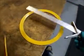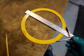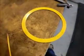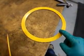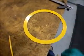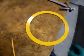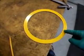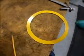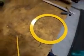I've taken this center finder and I've drawn a line across for the equator, or the center line of the circle. I'm going to drill a pilot hole for a screw and a pilot hole for a screw there. That'll allow me to mount it to the back of the router tabletop, and afterwards when we pull the screws out, those little pieces in the middle will be routed away, and you'll see later the router just lifts up, flips, and it'll drop through those little pieces, so we won't see those screw holes in the end.